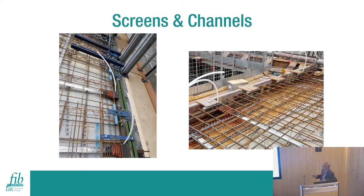We coordinated the tendons against the cladding channels, the climbing screens, tower crane ties, and all other elements. We also introduced a metal edge shutter with pre-formed holes, so anchors can be fitted before the edge piece goes onto the deck. This gives a very quick, uniform, and clean installation, compared to traditional timber edge shutters which require drilling every time and generally can't be reused.